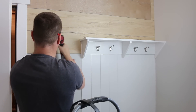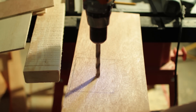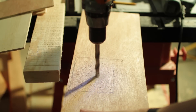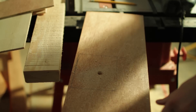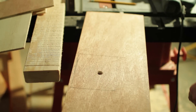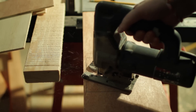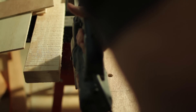If you find yourself in a situation where you have to place a board that completely covers up an outlet or a light switch, you can use a larger diameter drill bit — like a half inch, five eighths, or three quarters — to make a hole big enough for the jigsaw blade to fit into, and then use the saw to cut out the opening. If you find yourself having to leave a thinner piece, just make sure to take it slow so you don't break that piece off.